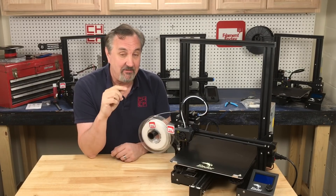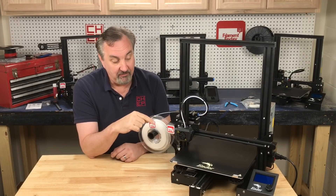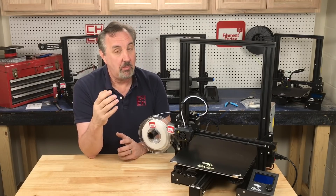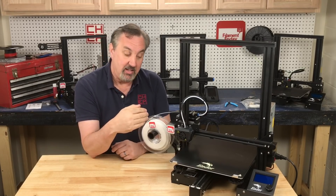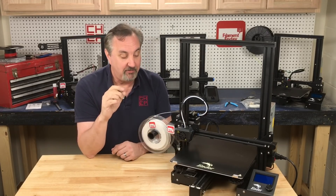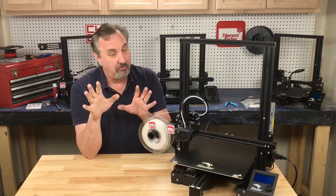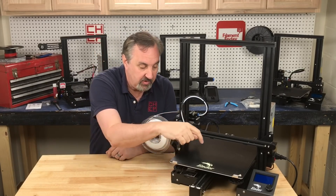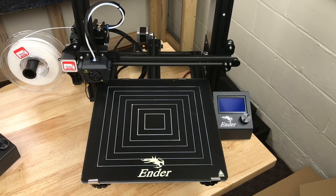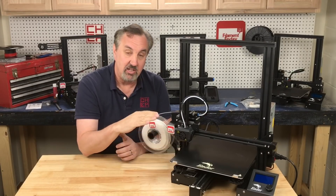Another thing they did: they fixed the firmware. The firmware on this machine runs better than any other Ender 3 I've used. In fact, it recognizes the M0 pause command, so my original bed level g-code will run on this. It's too big if you run the Ender 3 version, so I've modified it to fit the Ender 3 Max and I'm going to release that on my website — I'll put a link in the description below. That's a free download. It'll move to each adjustment knob, pause, let you slide paper underneath, then print multiple squares so you can level your bed. And this glass bed is incredibly flat.